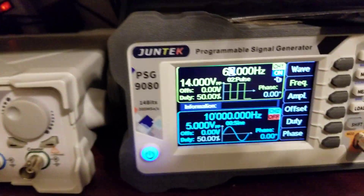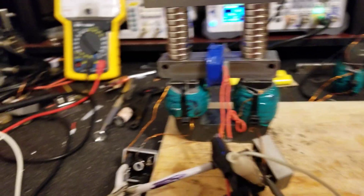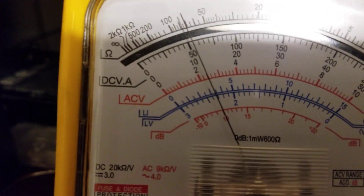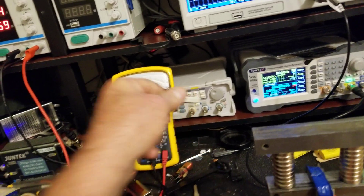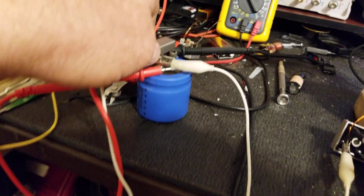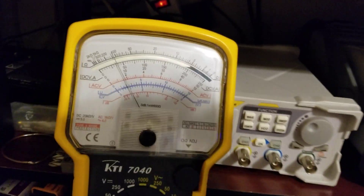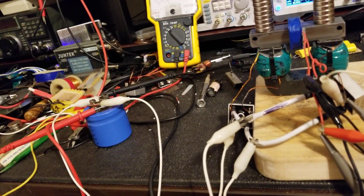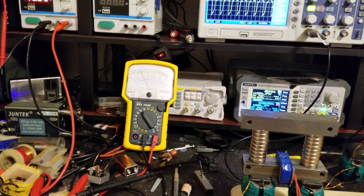We're running at 60 hertz, 50% duty cycle. 50% duty cycle is the strongest hit for flux switching — otherwise it's a little sluggish. That's our output coming in here. It's a pretty big arc. That was a short, and we're right back up to 50, pretty quick. I don't know what our short circuit current is on this, but I suspect it's pretty close to an amp, or maybe even right around 800 milliamps.